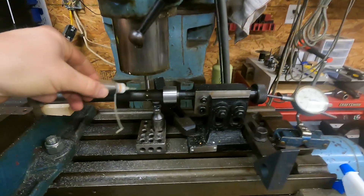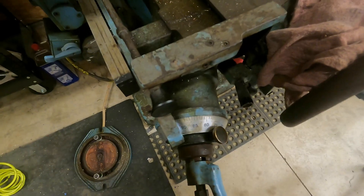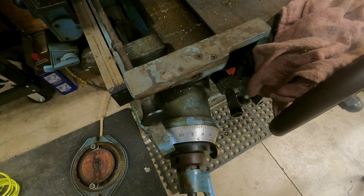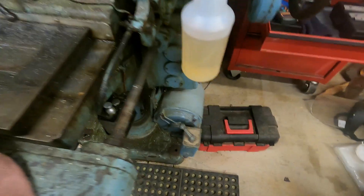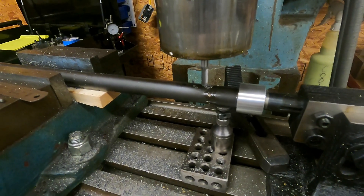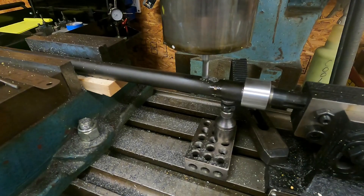We're going to put some oil on — I'm using Viper's Venom, it's a good high-quality, high-sulfur cutting oil. I've got my scale set at zero. We're going to go up 15 thousandths — you'll hear the mill bit kick in. Here's 15 thousandths; I've got my auto feed kick in and start cutting. I've got a machinist stack of two wood wedges there to help with damping vibration.